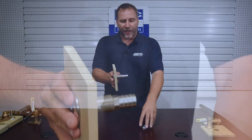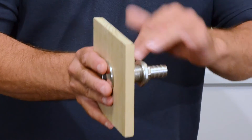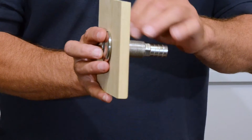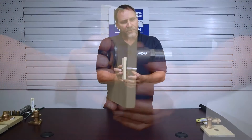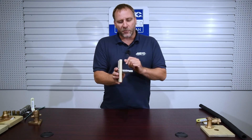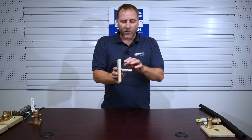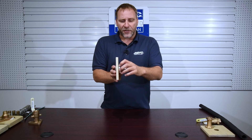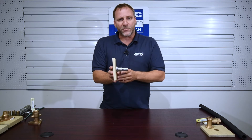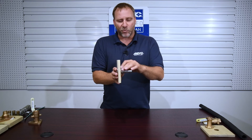On the inside, we would have this nut that we'd be putting on and tightening up. Just make sure when you're installing this type of through hull that you're aware of hull thickness. Some smaller boats can have some really thin hulls, so you want to make sure this is going to get tight and secure. If it's a thicker hull, you want to make sure you have enough strength here — you might need a backing plate. Maybe you have an imperfect hull and might have to form something to fit there. We want this nut to go flat against whatever you're sealing against.